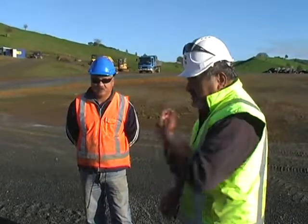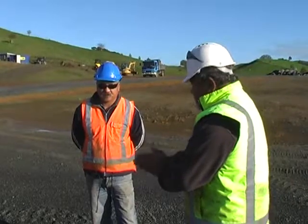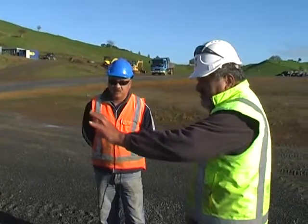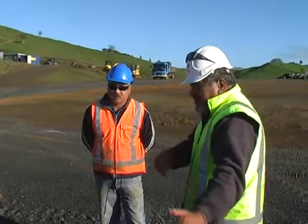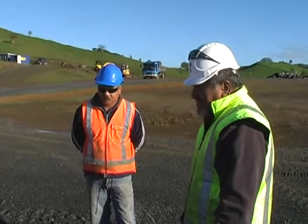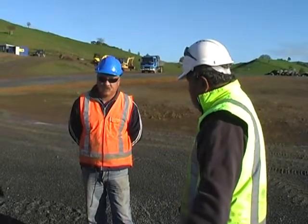Okay, it's only a simple exercise, but I think you get the point across before you start doing your recovery exercise. There are a number of steps that you go through. First of all, calculation of the casualty weight, the restraint that's placed upon you, and obviously the machine that you're going to need to tow the thing out has got to be capable of pulling that weight. A simple one, as you just set up, which is a straight pull, which is good.